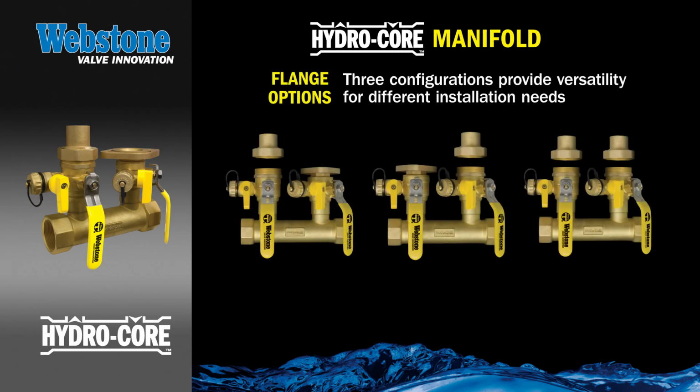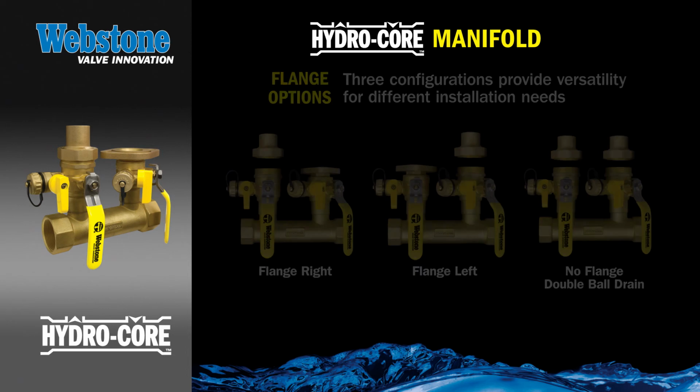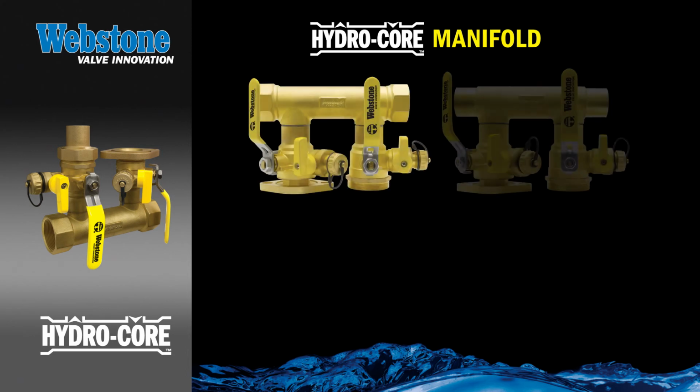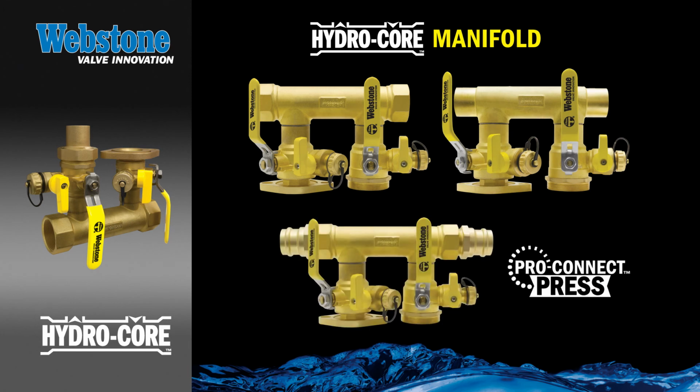The Hydrocore manifold is available with 3 different flange orientations to provide versatility and accommodate specific installation needs. Flanges are available on the right or left side of the manifold, or omitted for boilers with integral pumps. However, don't let the options overwhelm you. Webstone's boiler compatibility resources make it easy to identify the right Hydrocore kit for your specific boiler installation. Simply let us know if you prefer your manifold connections in threaded, sweat, or press, and let us do the rest.